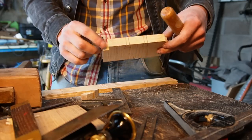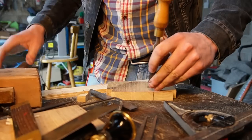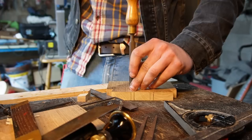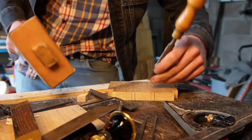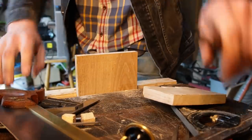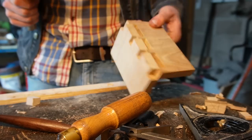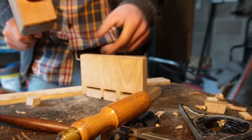I have them all cut out now. I used the saw to take the sides off, and now we're just coming along with our chisel, trying to remove the gaps where the pins will go in. I left my coping saw down in the other workshop, and as much as I give out about it, it'd certainly be handy to have right now. I've put the dovetails on top and marked out my pins. Now we're just going to come along with the dovetail saw again and cut down to the line.